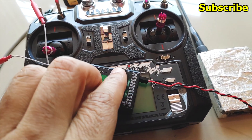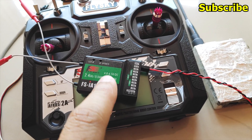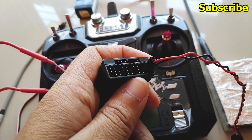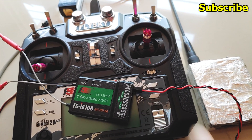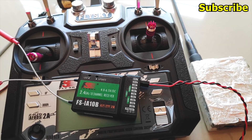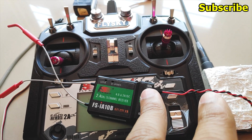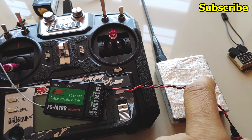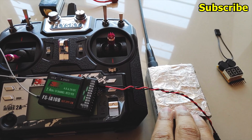After the power wire is connected to the receiver, the next thing that matters is how to power the UHF transmitter. What I've observed is that if I connect a voltage meter on any of the ports on this receiver, the reading I get is the same as the power input. So if I supply a 2S LiPo, the output is also about 7.4V; with a 3S LiPo I get about 11 to 12V from these ports. That means connecting a battery to my receiver will also power the UHF transmitter, since my UHF transmitter needs anywhere from 2 to 3S LiPo. I prefer to power it with 3S.